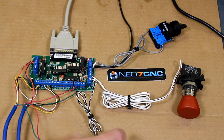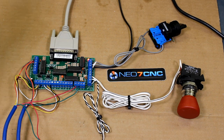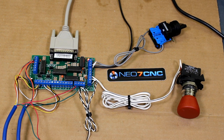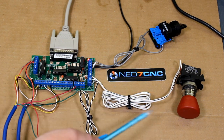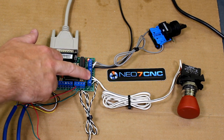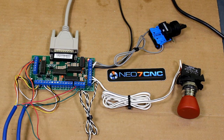The black and white wire here go into a simple Cherry switch — this would be a home switch so that when you reference all axes, they move to their home position, engage the switch, back off, and give you your zero-zero-zero machine position. That makes fixed fixtures and jigs more repeatable. The big white wire going to the big red button is the e-stop. Mach 3 requires an e-stop, and it's a normally closed switch — meaning the two wires have continuity. Pressing the button breaks that continuity, drops the contact, and Mach 3 sees an error condition and stops everything.